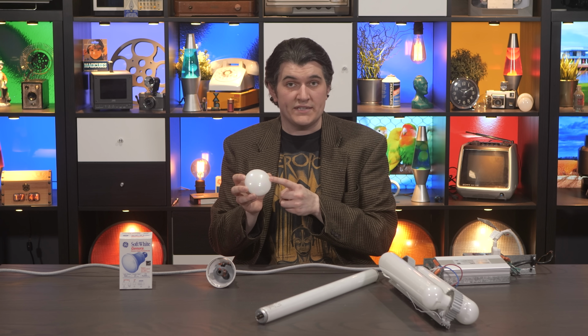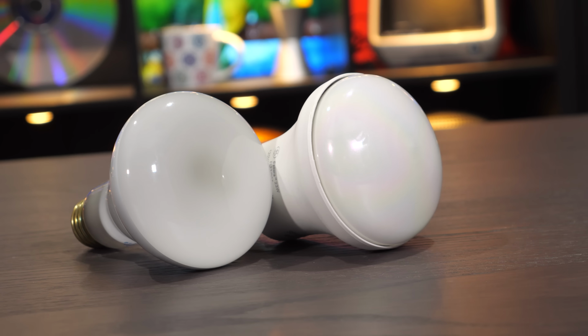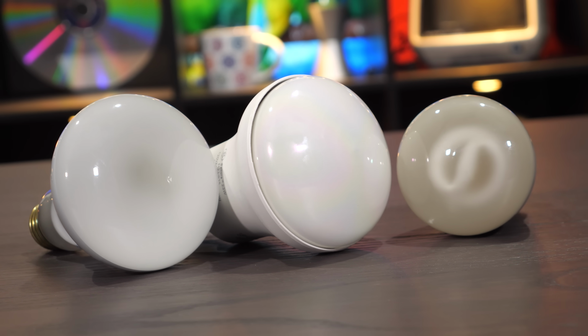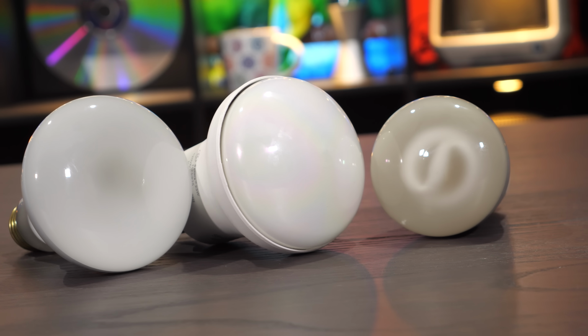Consider the GE bulb. The resulting discharge inside this vessel produces a compact but powerful ring of UV light just under a relatively flat piece of glass. This meant fluorescent technology could not only mimic the appearance of an incandescent reflector much more faithfully than sticking a coiled tube inside a fake bulb, but it was also much more effective. This flavor of induction technology was able to create much more powerful, yet also compact light sources than a linear fluorescent tube, while still offering similar energy efficiency.